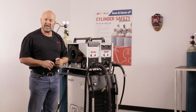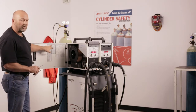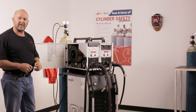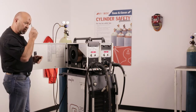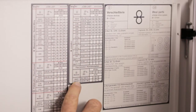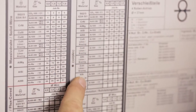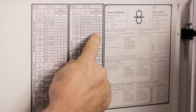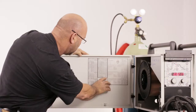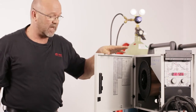It's simple to set a program in here. Looking at the features, we have all the waveforms. We have a pipe solution program, which is what we're going to dial into the machine. It's simply by selecting pipe solution, then the type of gas, the type of wire and the size of wire. So we come across and we dial in 174. Program 174 is what we want to use for this welding application.